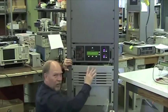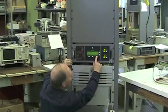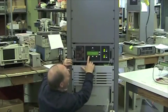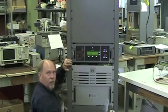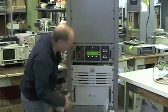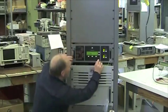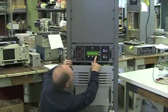As you can see, there's a delay. When I push the button, nothing happens. That's normal. And we're going to press back, I'm going to press power again, you're going to press next, and you can hit preset 3. And there are 6 of them. I'm not going to go through all of them, but you can set any preset to any power level you want. Typically when you receive a transmitter, you're going to have one of them that's set to 0, and that's the one you should start out with. So you can get familiar with the transmitter. And that is the power settings.